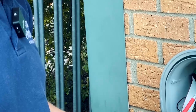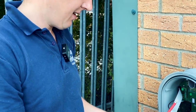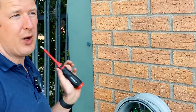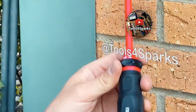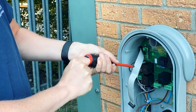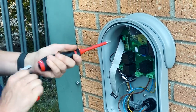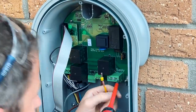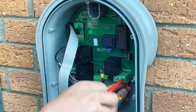The reason I got this torque screwdriver is because my other one doesn't go above 3 Newton metres, and for Hager main switches you sometimes need 3.5 Newton metres of torque. I've done a review on my Tools for Sparks channel about it — head over there if you haven't done so already. To adjust the torque you just put the adjustment device in and turn it — I need 1.2 Nm, which is quite low. These are those kind of sliding terminals where if you're not careful you can end up putting the wire behind the lug rather than in front of it.